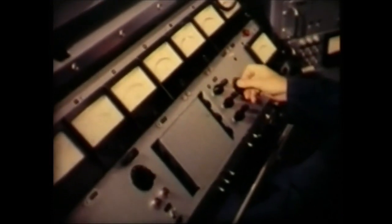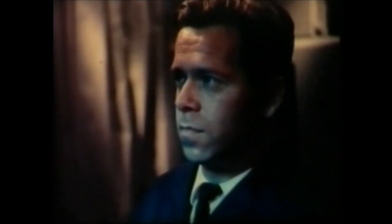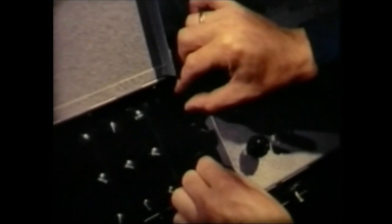Before leaving the factory, however, it is thoroughly tested. The measurements made of cutoff voltage, emission, white field uniformity, vacuum, brightness, convergence, and beam landing are only some of the many checks carried out. The tubes are sent to the packing department. From there, they are dispatched to customers in many parts of the world.